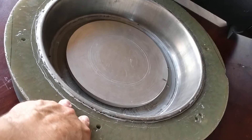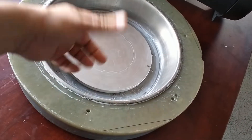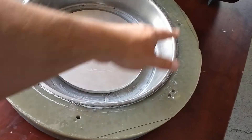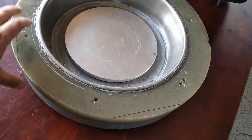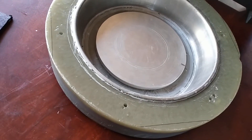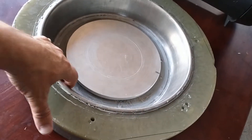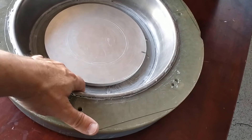To fix this problem, I went to a female or negative tool rather than a male tool. This is basically a dog bowl, which is the same tool I ended up using — just repurposed. I cut it down to the right height and placed it inside an epoxy and aluminium filled shroud. I've still got to put framing on this, but it still works. I actually screwed my plastic in through these holes, but I'm going to put plates on it so I can just clamp it all down and make changeover much faster. It's a hollow cavity with a single hole underneath, and because the plate in the middle is not sealed, air is able to be sucked in from underneath.